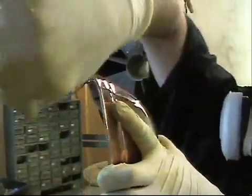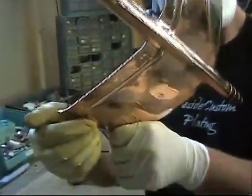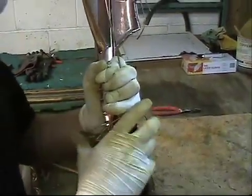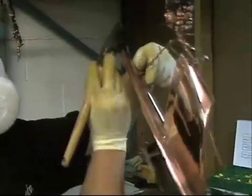You can now re-rack, avoiding as much contact as possible with the copper wire. This particular part has sharp corners and a pointed nose, which can burn easily in the nickel tank. The copper wire must be wrapped around the sensitive areas without touching them to prevent burning. When racking is finished, the part is then cleaned with kerosene and a soft bristled brush.